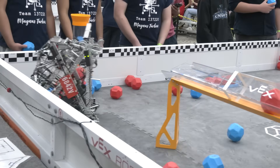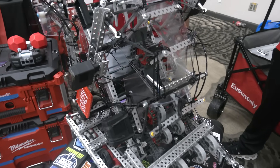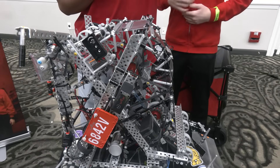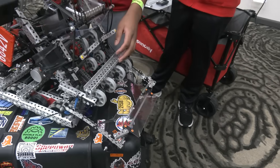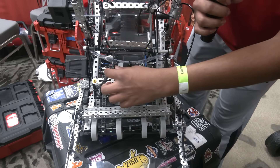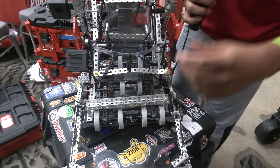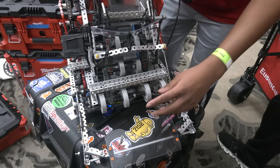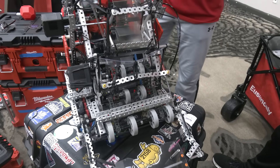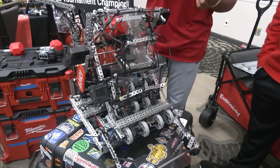As we talk about the intake, I'd love to hear more about your motor decision and gearing. We've had many iterations on the intake. What we do that's pretty unique is — most teams run their intake at 600 RPM, but we wanted to run certain parts at 1,200 RPM. This motor controls the first three sets of flex wheels at 600 RPM, but then we gear a 12-tooth sprocket to a 6-tooth sprocket, so that 600 RPM multiplies by two to run the next two flex wheels at 1,200 RPM. This makes our intaking very smooth, especially during match loading. We can pick blocks up almost instantly — our cycle time to clear the match loader is around 1.1 seconds, which helps a lot in skills and in matches.